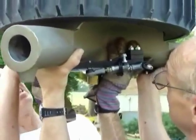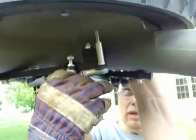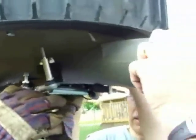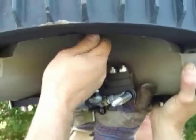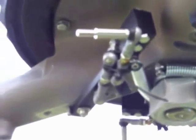We're looking at putting the big nut on as a safety. The magnets weren't pulling it back — it was just stuck, the paint was stuck to it, and it's recessed in there. We've got nine bolts around the outside that hold the hub to what I'm going to call the magnetic rotor pack, for lack of better terminology. The three center bolts are snugged up and the six outer bolts are a little loose. We're taking the electric brake off to check for drag and doing some tightening and loosening — we may not have all the outer bolts tightened enough yet at 30 foot-pounds.